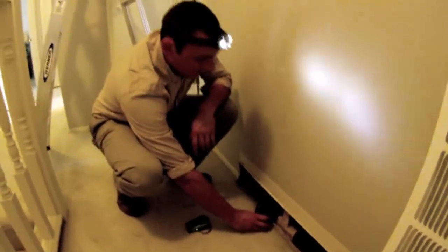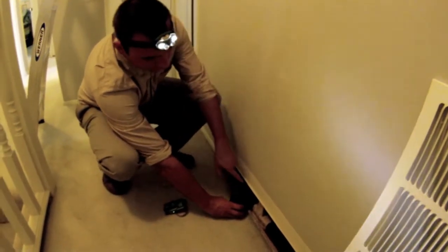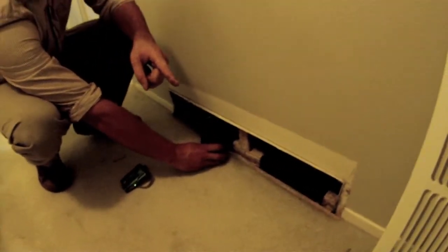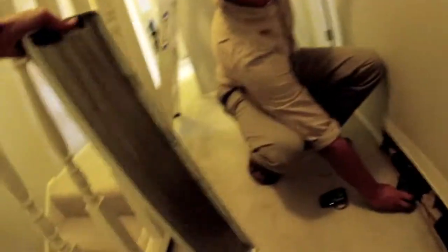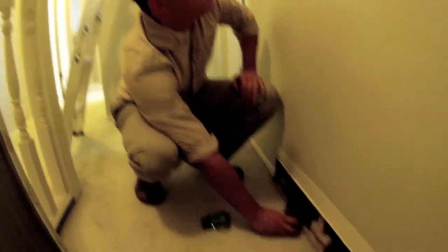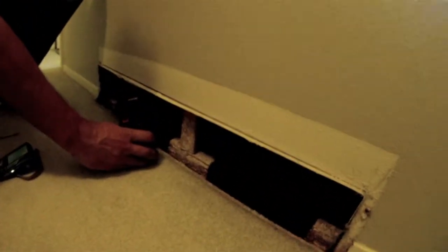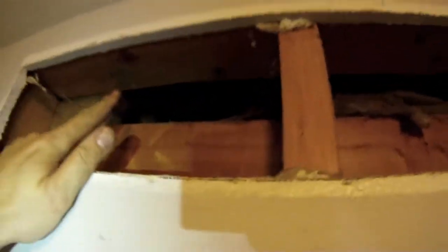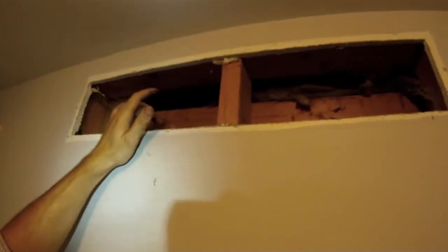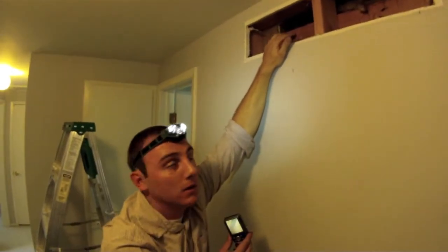This is a return, and this is on the floor next to the master where we found a big leak from the blower door test. This is duct taped off through the registered grill of the return grill. That one up there is wide open and it's got direct connectivity to the attic, which means it's introducing hundreds of CFM of outside air into the house, causing both a dust problem and an inefficient furnace. You want it to be a closed loop system. This return is pulling air from the attic all the way downstairs and introducing it into the heating or cooling system depending on which is used.